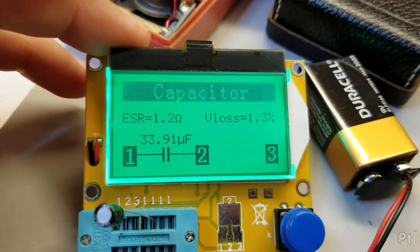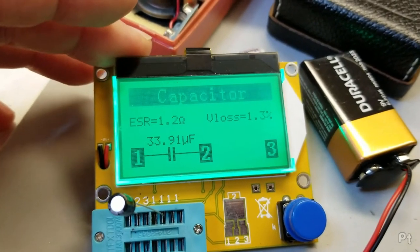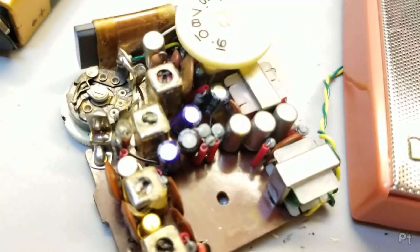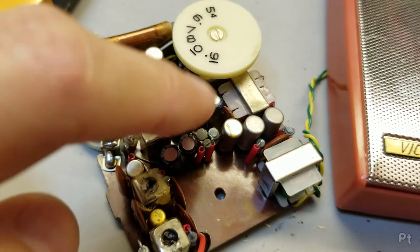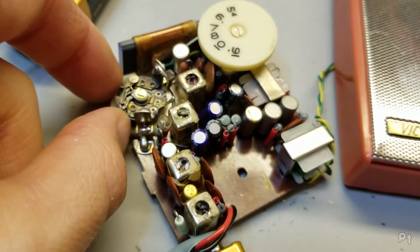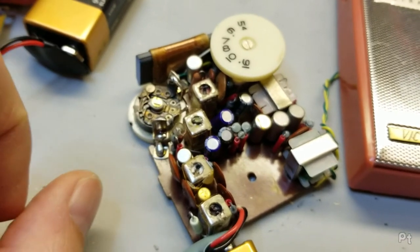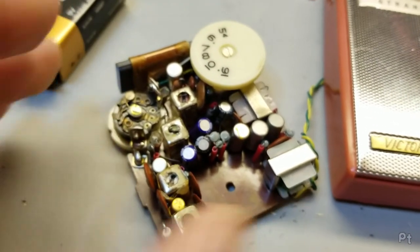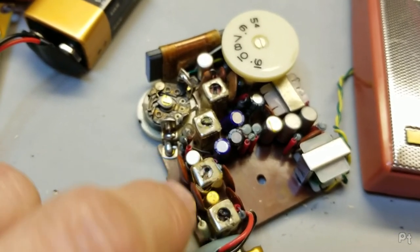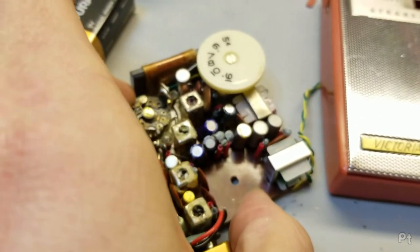Still bad though. Very bad. Here's what the replacement's going to be — a 33 microfarad, the original was 30. Capacitors have been replaced — all four of them. Two 10 microfarad and two 30s — all of them tested horribly, not even borderline, just awful. Put some contact cleaner in, tightened some loose connections, and gave it as much of an alignment as I could. These coils were just full of wax, and without completely stripping the cores, I was able to get it slightly better. The top end was a little bit deaf before — it still is, but it's better.